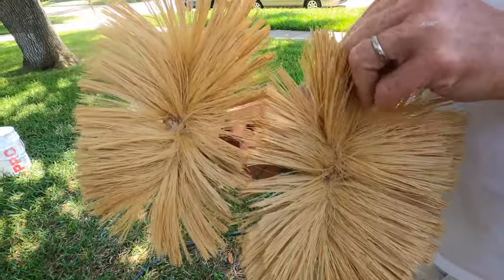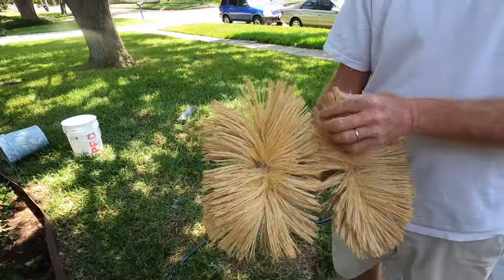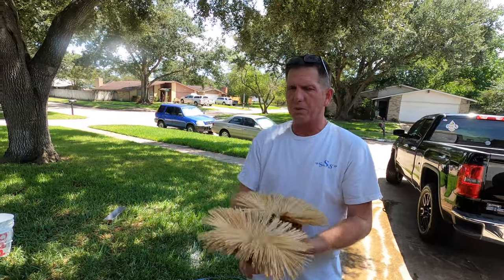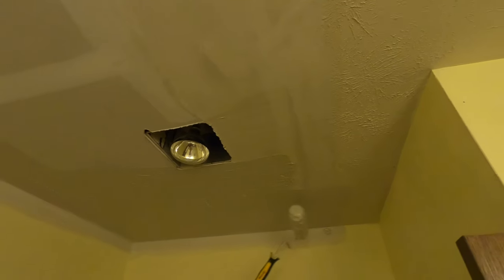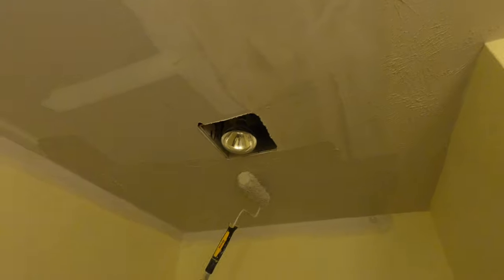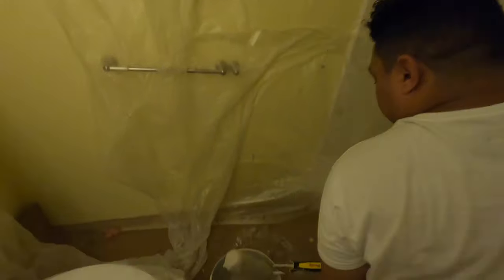So this technique we're about to show you — we're going to walk in here now. My guy Ernesto's in there rolling. With my other video I sprayed it, but we're going to show you another way to do it as far as the application of the mud. So follow me. I'm real close up on the texture. It's just a real light stomp. There are multiple ways to apply the mud — you can spray it, you can roll it, you can put it on with the brush. What we're doing here now, as you can see, he's rolling it on. So we've got everything covered up — walls are covered, floors are covered — because it does leave a pretty good excess of mud. When you're rolling, you're going to have over-roll, if you will.